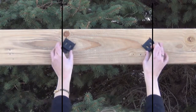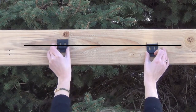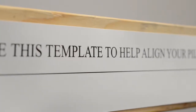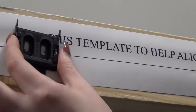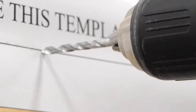It is very important that your valence brackets are installed level with each other. Your shade will not install correctly unless your valence brackets are perfectly aligned. Your shade comes with an installation template to align your pilot holes. Start by temporarily attaching the template to the mounting surface, make sure it is level and flat, then mark and drill your pilot holes. Remove the template before installing your valence brackets.